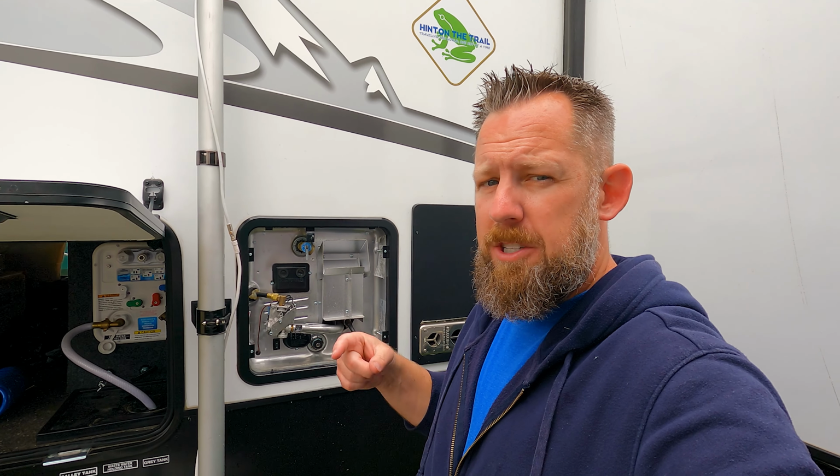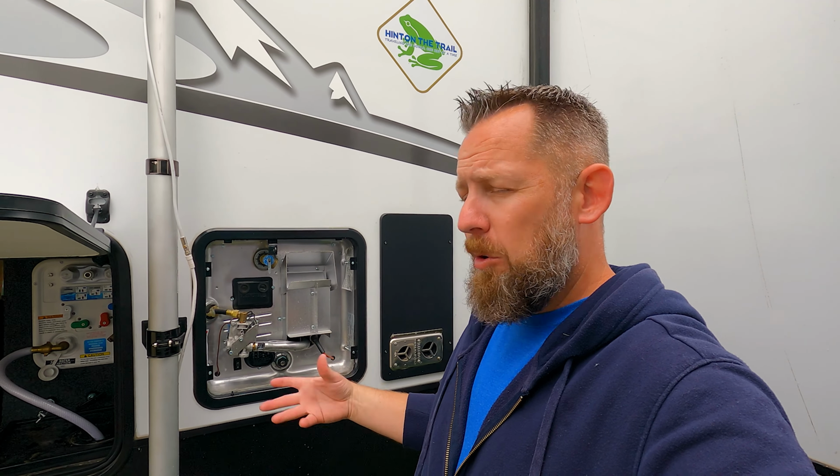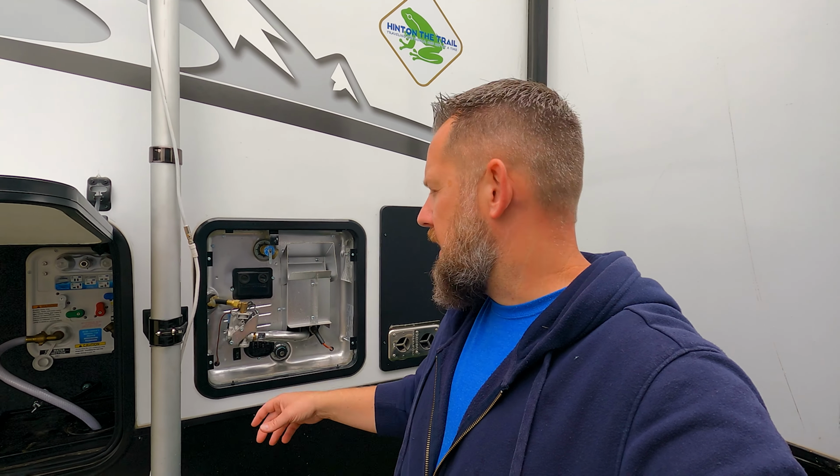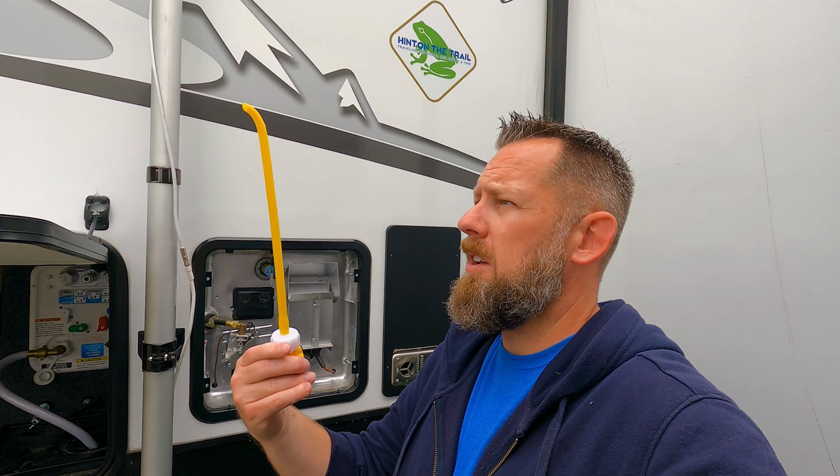Again, the preparation may take a little bit of time, but if you take away turning off the hot water tank and letting it sit for a while, this whole process is 15-20 minutes. That's also depending on how dirty the inside of your tank is as you're scrubbing it out with your giant size dental tool.